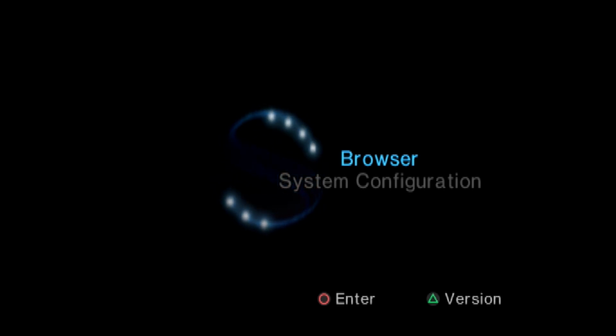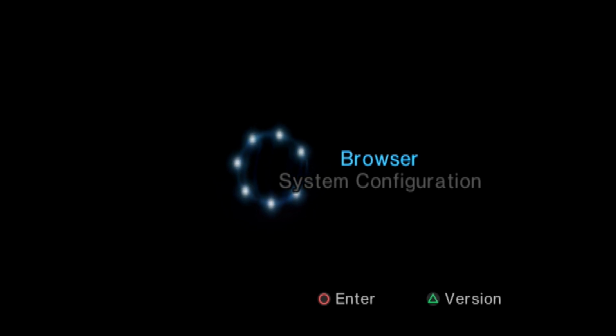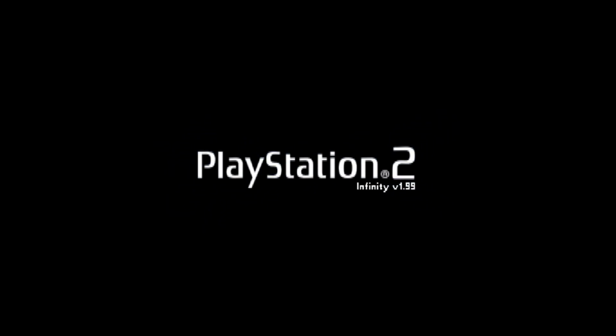So probably gonna want to either upgrade or use an external scaler, which is what I plan to do. Run this into my Tink 5X until the 4K comes out, and I either buy a Morph or I grab the Tink 4K, whichever one seems better in my setup. I'll have to see as they both come out, but yeah, you'll see that shimmering going on. I would like to do a test to see how this looks running it into my Tink 5X, so going HDMI out on the PS2 with the GEM, going into an HDMI to component, then running that into the Tink, and that's going to do the upscaling. Should handle the deinterlacing, and I'd like to see how that compares to analog, but that's for another video.